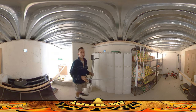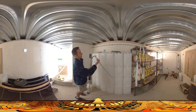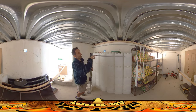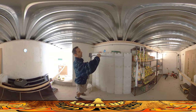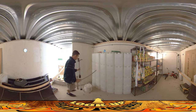More than a couple of bends can get a little bit tricky. Also, you've got to make sure that the direction you push the wire through is not going to be difficult for you. This is a union right here — this is the male piece, and here's the female piece it goes into right there. If I tried to run wire up through it this way, it's going to hit on the corner of this pipe and be difficult to get through. So as I'm running wire through here, it needs to come from this side and then go down in through that way.